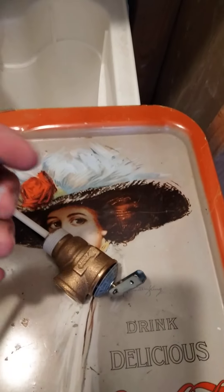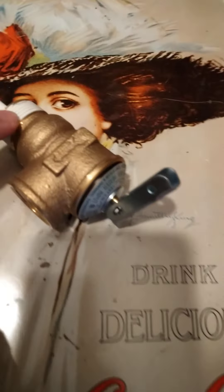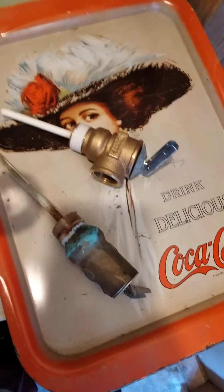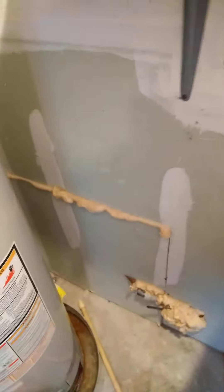Here's the new valve — you can see the spring-loaded valve inside. Here's the old one; it's got a bunch of buildup inside. These are designed to essentially never open if the water heater is operating correctly, so they really should outlast the unit. The new one already has some pipe tape on it, but I'm going to add a little additional tape just to be safe. Don't buy cheap dollar store brand tape — go to Lowe's, Home Depot, or a plumbing supply for quality tape; it actually makes a big difference. You can also use the liquid variety.